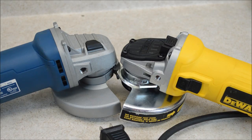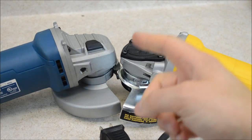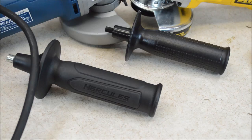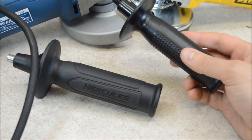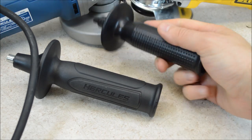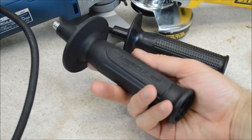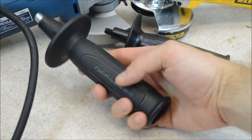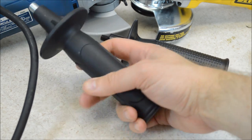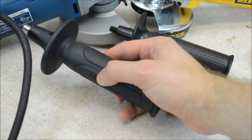To try to minimize the confusion, in all the shots, the DeWalt and its parts will be on the right, and the Harbor Freight will be on the left. First up, we have the handles. The DeWalt is simple ABS plastic — it's not very thick, there's nothing fancy here. The Hercules is glass fiber reinforced nylon and it's pretty beefy, plus it has thermoplastic elastomer areas, these rubberized spots for grip. So definitely nicer here on the Hercules.